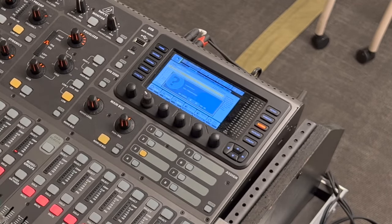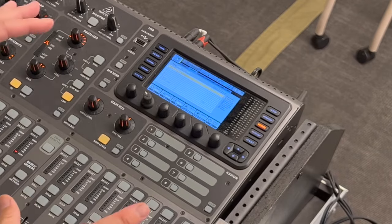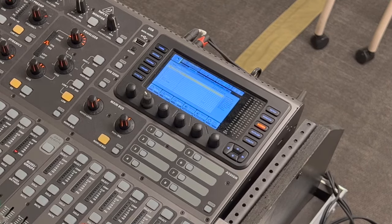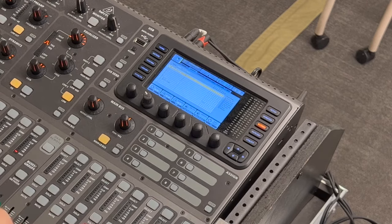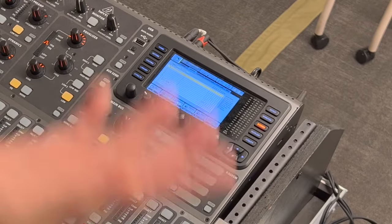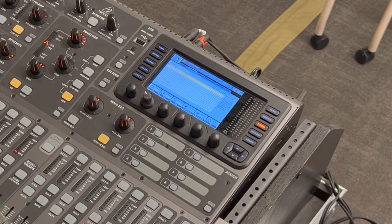Then it's going to ask you a question: load scenes. Using this cursor, you either say no or yes. If you say yes, everything that we pre-saved — our default settings — will load up. That's really important because sometimes we'll have cajon, sometimes violin, sometimes different instruments, and we'll have adjusted faders, gains, and EQs. Instead of having to manually readjust everything, all you have to do is go to Scenes, load it up, and you're ready to go. Also, if you accidentally messed with someone's gain or EQ and don't know how to undo it, you just go to Scenes, load up Stream Bows, and whatever we had previously saved will load up — assuming you didn't save your mistake.